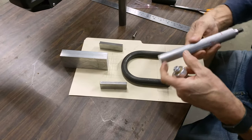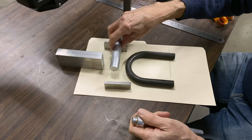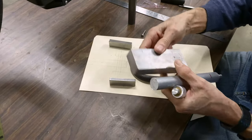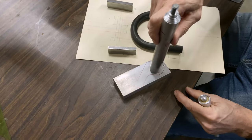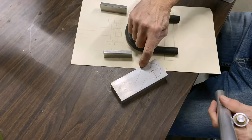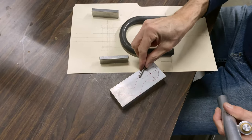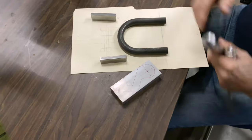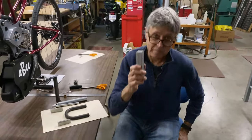So the bushings are going to go into that hole across like that. So that's why we're putting an inch hole here, because that's going to go through, and it's going to have a pinch lug as well down that way. We got lots to do. First step is the mill.